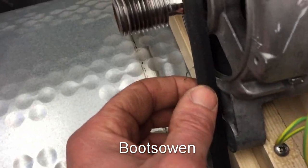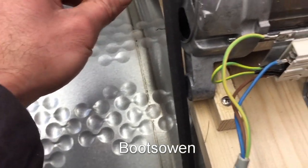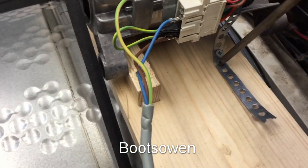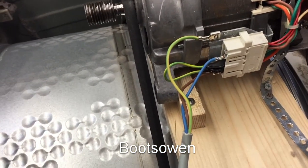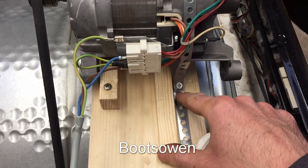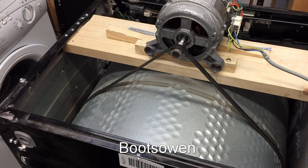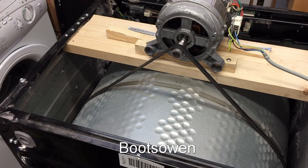So what happened there — you heard the noise change. The belt jumped from over here to over here, so I think I have this at the wrong angle. Not really sure how to adjust it. I wonder if I let off the tension a bit here. If I put a bit of a wedge under here I might tilt it up a bit and might get it back on track. I've loosened the tension, put a bit of wood underneath it and tightened it up again, then put it back on and hopefully it'll track correctly now. There's a bit of slipping on that belt there.